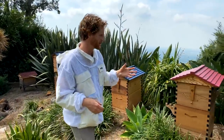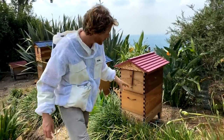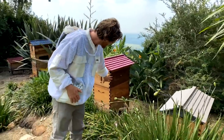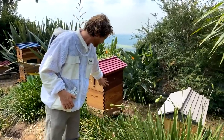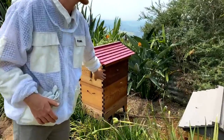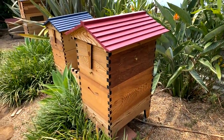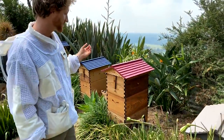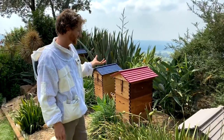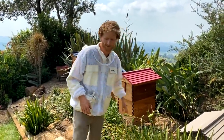If you go up the row here, you'll find different examples of the wood. There's such beautiful wood tones from dark to light. So typically this is a linseed oil we've used, and it's one that's got a solvent in it, so it really soaks in. It's just from the local hardware store, and if you reapply it every 6 or 12 months and give it a little rub back, you can keep it looking good for years.